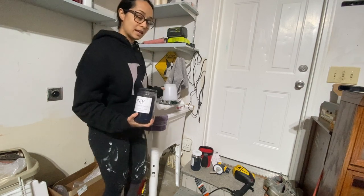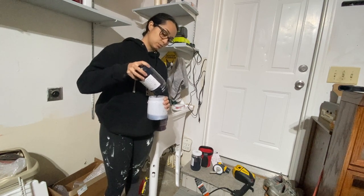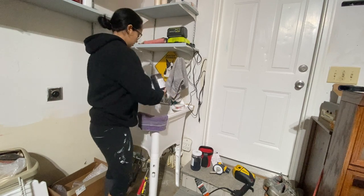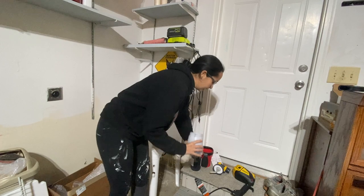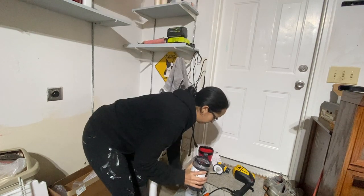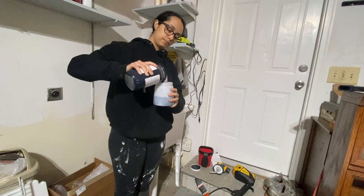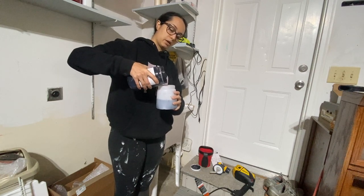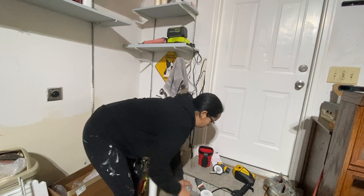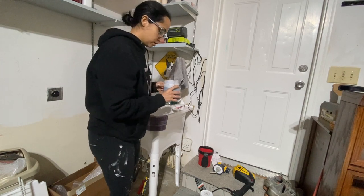If you haven't checked out my paint review of this paint make sure to go check it out — it is a really good paint and I'm extremely happy with the way that it goes on, the way that it finishes, everything about it. When you're putting paint in, you can either mix it with water if it's water-based, or mix it with mineral spirits if it's oil-based, just to make it a little bit thinner and easier for the paint sprayer to push out. With this paint I already watered it down so it should only need just a tiny little dash.